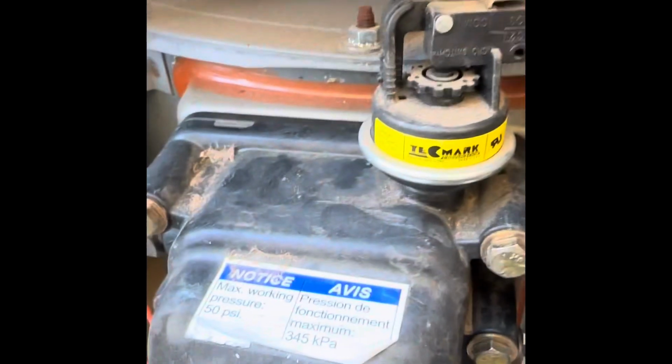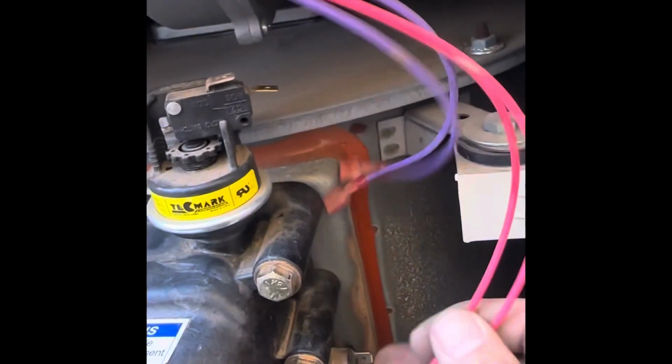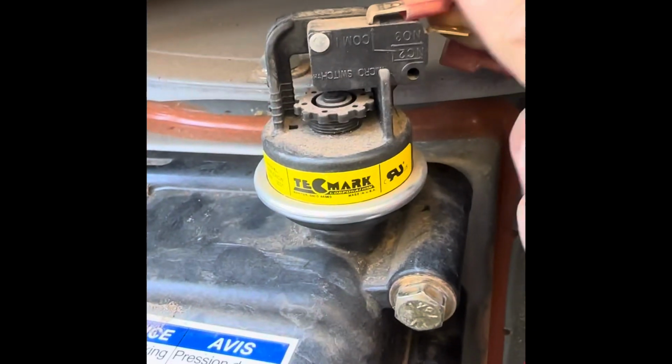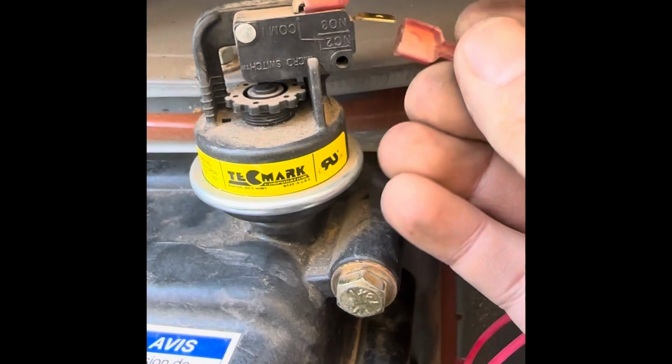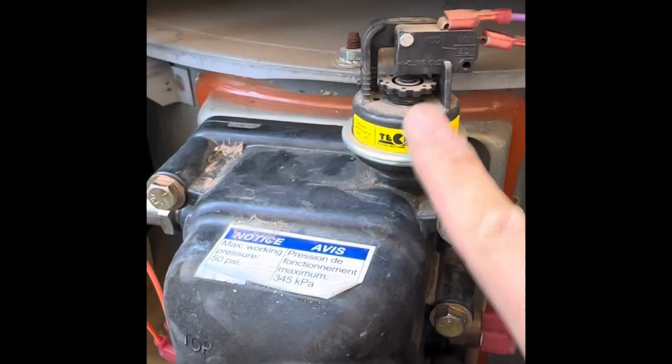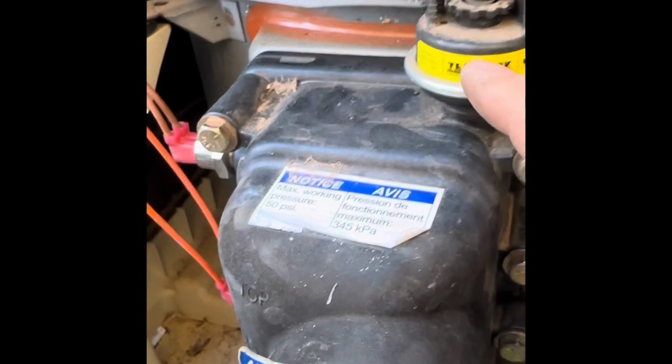Okay. Pull these out over here. Got one down here. Actually, that was the thermistor up there. This is the AGS over here. Sorry, doesn't really matter, as long as you know. And the pressure switch up here, attached. As long as you know the pressure switch is on top of the manifold, not on the bottom, or else you've got it upside down. So pressure switch on top. Now we're going to put the cap back on.